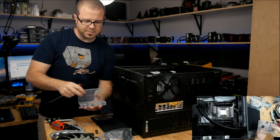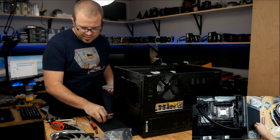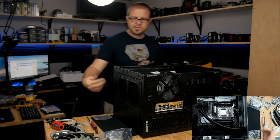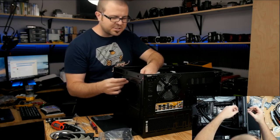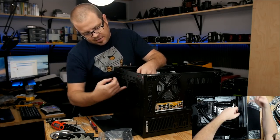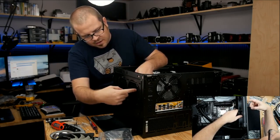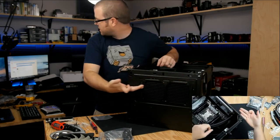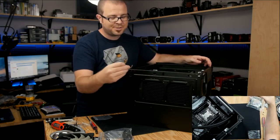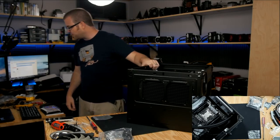One thing you should always keep an eye on if you're mounting a radiator like this is to try to use the screws that came with the radiator if you can. Again, I'm not sure if this is just me being confused because I have lots of stuff going on here and I set it aside wrong, or because I was supposed to have the washers here, but even with the washers, I feel like they would still be a little on the long side. If you're screwing into a radiator, it's got these channels that go up and down. There are fins in between, and those can get bent, which you don't want, but that's not a huge deal. The horizontal lines in between, which you probably can't see, are the actual channels with fluid in them. If you screw a screw into one of those and puncture it, the radiator's dead. It's gone, so that's something to keep an eye out for.